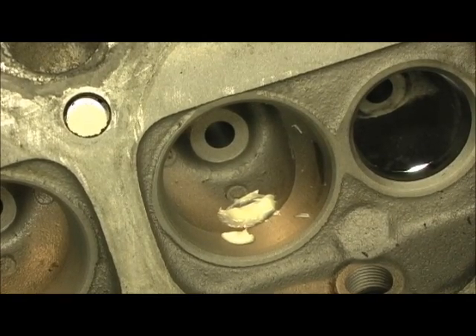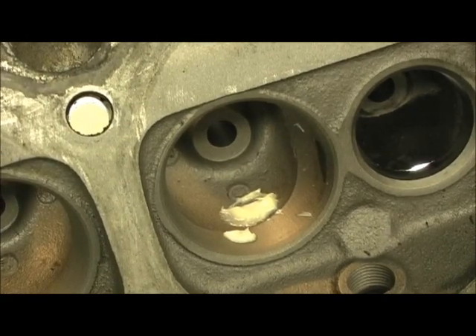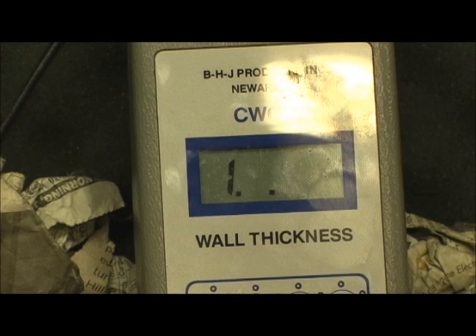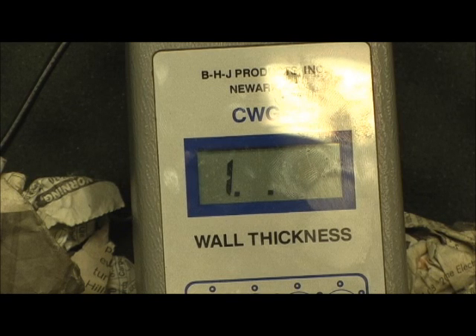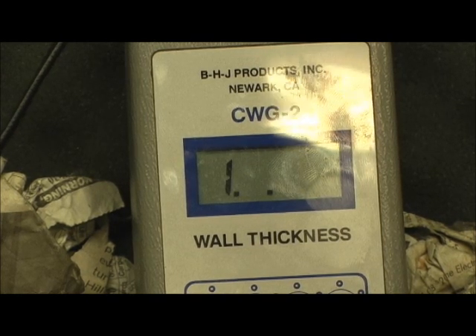I want to show you now what the sonic checker looks like while this is going on. Keep your eyes on the machine and I'm going to do exactly the spot I was just doing where you can see the gauge numbers. Look at the jump — this is where it will just absolutely drive you out of your mind sometimes. See how it jumps? Look at them numbers all over the place from six to two. But as you move this around it'll settle in, and you know the feel. See, I'm getting 222. I'm moving it backwards — it's kind of like using a dial bore gauge. Right there where it seems to be sticking the best. Now, I saw the number 216, 214.